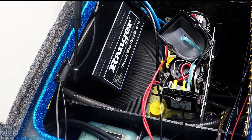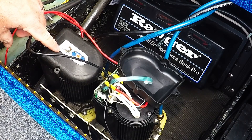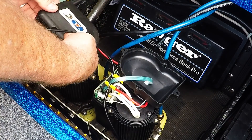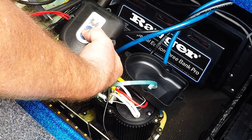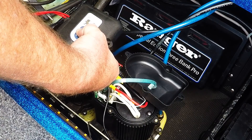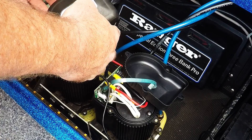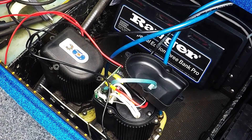There are instructions on scanning with the computer tool to scan the USB ports to pick up your pumps. Your pumps have to be powered on and in program mode — you can see this one's light is blinking. The easiest way to enter program mode is to hold down the power button while it's on, then turn the power off, then cut the power back on while still holding that button. You just heard my computer beep — hold that button for a second, the light stays green, and you're now in program mode.